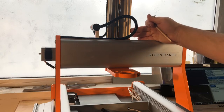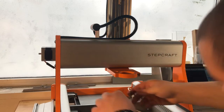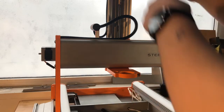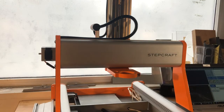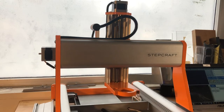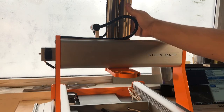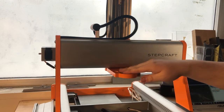What you just heard is the sound of what I'd call a healthy axis — no screeching, no metal-on-metal sounds, no mechanical binding. Now that we can get it to home, let's go back and snug up those bolts using the short end, making sure they're nice and tight, then snug up the top bolts as well. To confirm the Z axis is in alignment, change the jog feed percentage to 100% or hit Shift and Page Down, and run the axis back and forth at 100% feed rate.